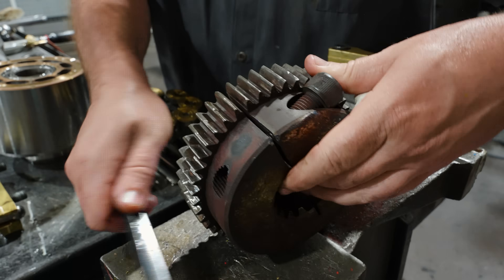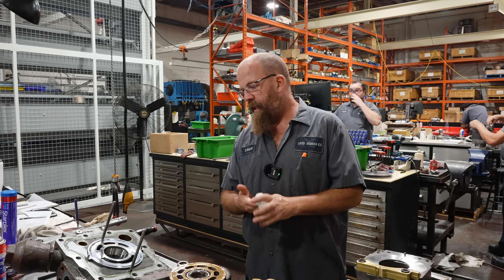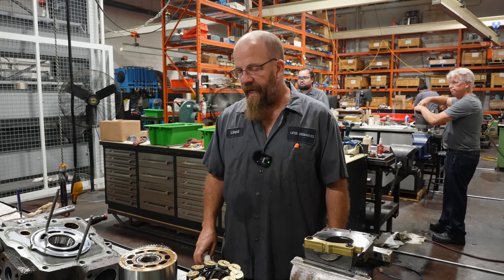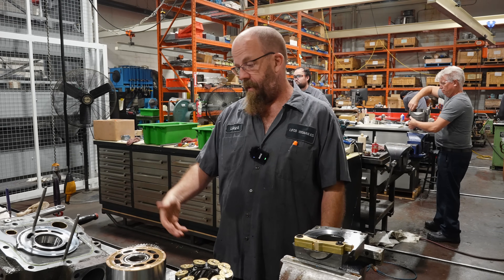They may have sent this in because they need a new one — if you look here, you can see all the wear; about half the life is worn off this coupler. In a lot of cases they can't get it off because it's seized on, so they'll just send it with the unit. They took off the back mounting flange for the rear unit and gave us both couplings. That drive gear-looking thing was worn out. In the report I have to note that the rear mount wasn't sent in, the coupler was sent in worn and should be replaced — do not reuse.